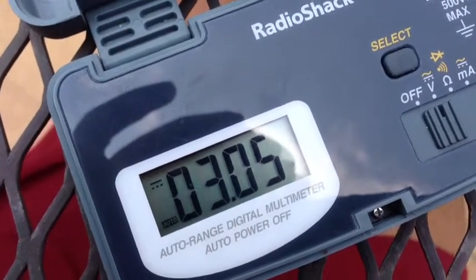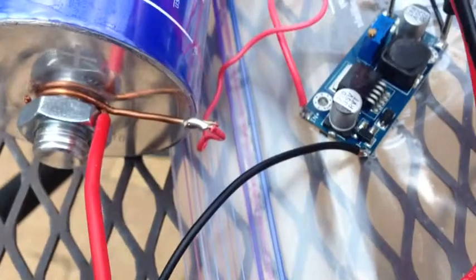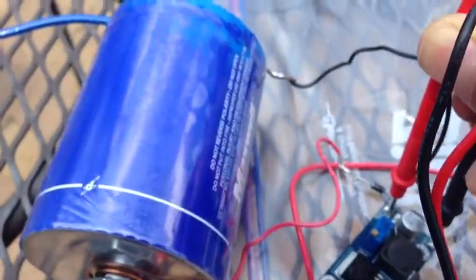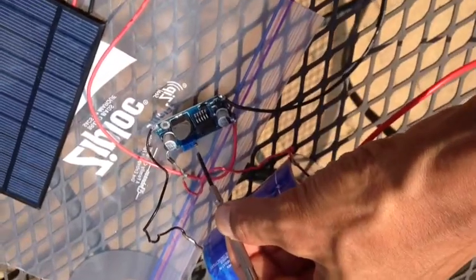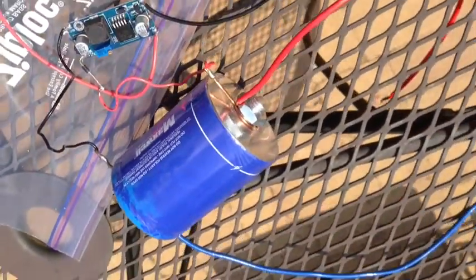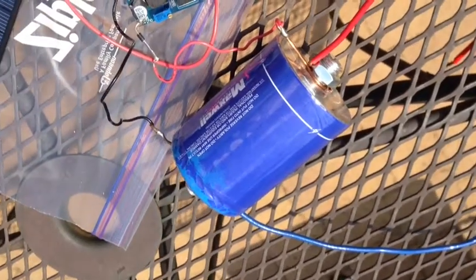The time is about 2 p.m., and it's 3.05 volts being generated on the buck converter, as you can see there — measured just before the diode that goes to this capacitor. That's not really enough to charge the capacitor up any further, because when I measure the capacitor I'm getting 2.35 volts, and it's pretty much stuck on 2.35 volts. I just adjusted the buck output to 3.16 volts, which should provide more voltage difference to further charge the capacitor.